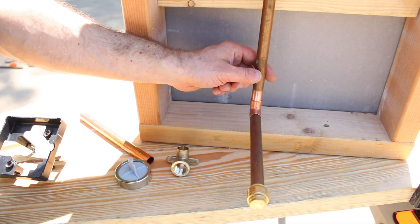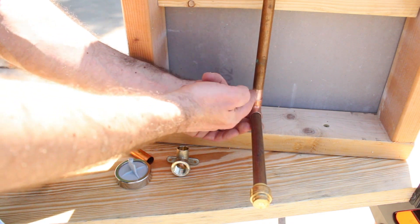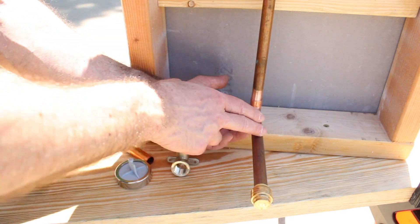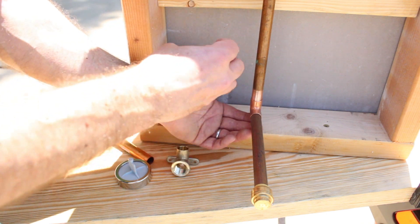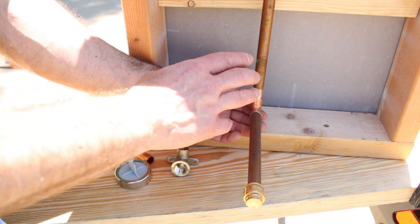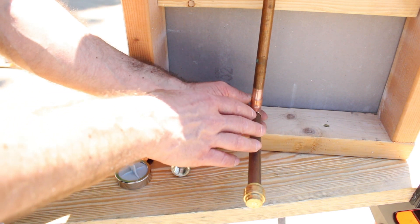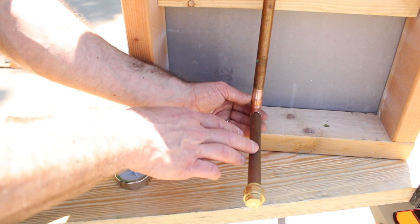Two important things about this pipe. Number one, it should not be loose — try to make it as rigid as possible. It wouldn't hurt to have blocking behind it and attach the copper pipe to the blocking using a copper strap. Number two, never use PEX or any pipe other than copper for this run and the spout portion — Delta and many other companies specify that. Only use copper for the bottom port and tub spout. Number three, this horizontal run of pipe should be perfectly lined up with the tub drain. Make sure that's done before you solder everything in place, so the pipe runs down and out as straight and parallel as possible with the drain.